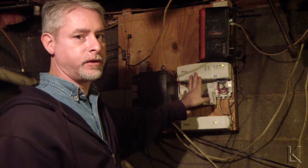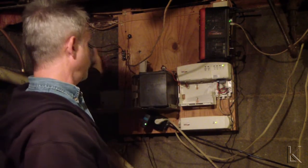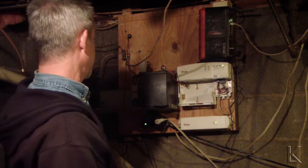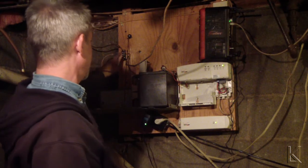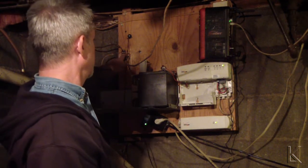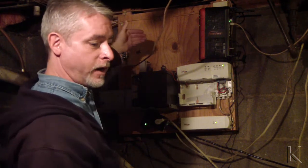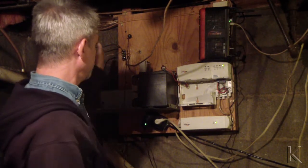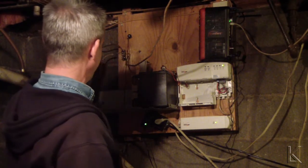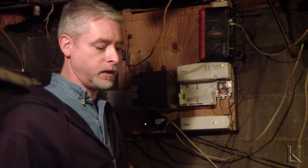That should bleed off the interference. And just to make sure we don't have any other interference coming in through the telephone line — because my terminal has a phone line connection which comes in here — I'm going to take a couple of 0.001 µF capacitors from the two phone lines to ground to bleed off RF. The 0.001 caps are not going to interfere with the telephone signal, and they should bleed off any RF coming in through the phone lines from the terminal. So I'm going to get all those wires installed and then we'll go upstairs and look at the radio and see if it's any quieter.